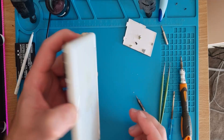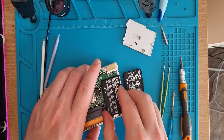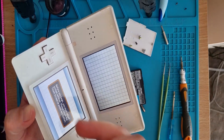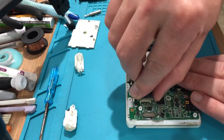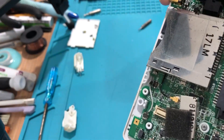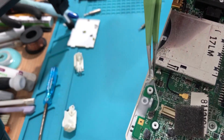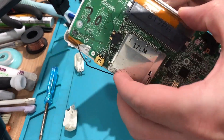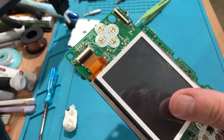Let's put a battery in — okay, that one's dead, let's try a different one. Both screens are alright. It turns on but no touch response. Someone's definitely opened this one before. Have a look at this — the digitizer is not plugged in. Whoever had it open before couldn't or wouldn't fix it. The actual traces on that connector are broken, so maybe they realized they broke it, gave up, and just put the back on.